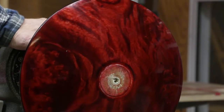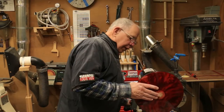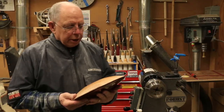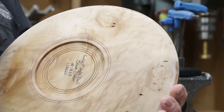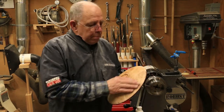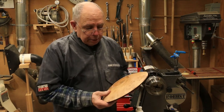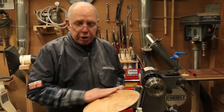That's a gorgeous piece. We'll have pictures of this once you complete it as well. I'll take it off here and try to show it. I did put a coat of oil on this back before I even started putting the dye on — I want to fill in any open pores so that any liquid or dye doesn't come all the way through to the back side. So I'll put some oil on here beforehand, and it's already finished — signed and dated. That little ring of white that might show on camera is just part of the slurry — wipe that off with DNA or water — and then I'll come back and put another coat of oil on here.